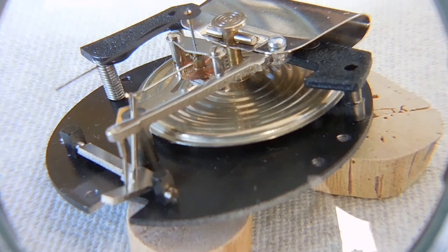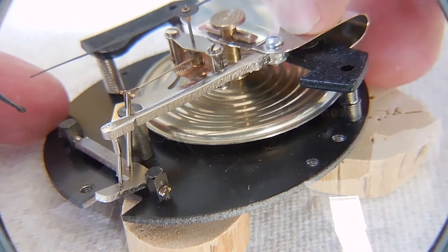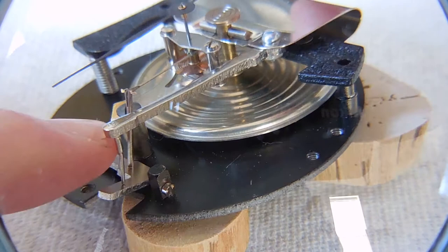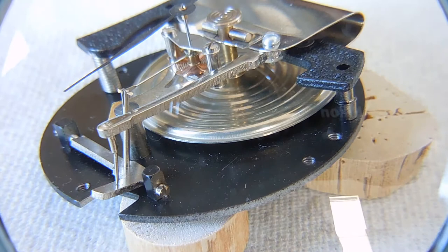The question is what needed to be fixed. A lot of the construction on this is pretty fine. This arm was attached to the spring clip right where that screw is with a rivet. After a period of time, the flexing caused the rivet to fail. So I replaced the rivet with a screw - hopefully that'll keep it going a little bit longer. The screw is solid enough so that when the bellows open and close, the lever arm can be pushed against the anvil at the bottom. There's a lot of pressure there for that little screw to hold, but it should do for a little longer.